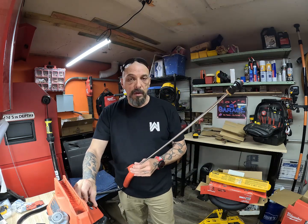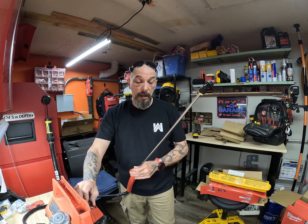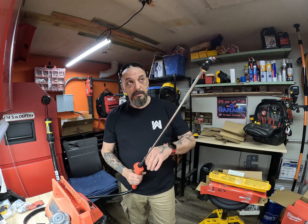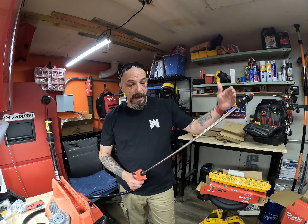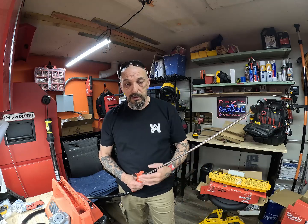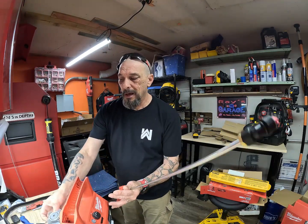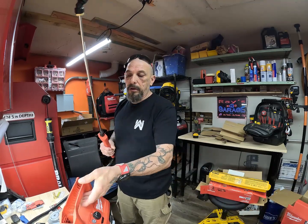It goes from real light pressure all the way up to, it's supposed to be like 80 psi. That's more than enough. That's actually too much at 80 to be pushing dirt through the coil, because the back of these coils is just like insulation board back there. So once it gets back, it just runs down and runs right into the drip pan, and then out into the condensation line. This right here, I only got the 1 gallon container. I'm in an apartment, so I don't need to carry 2 gallons around.